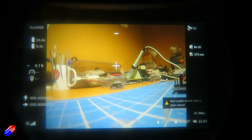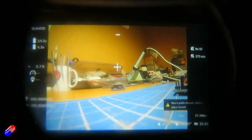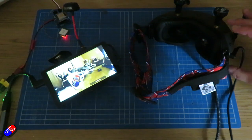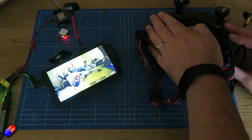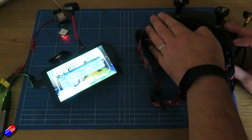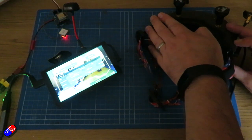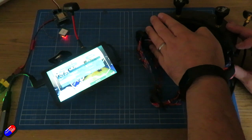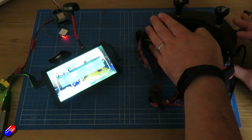I did also test this with Walksnail. Sadly, it didn't work with Walksnail. I've fed that back to David and I will be testing it, so as soon as there's a Walksnail-capable version available, that'll be great. It might need some tweaks with the code but I'll liaise with Walksnail as well. This should work with standard Betaflight MSP telemetry. I did change the OSD type in the Walksnail goggles to Betaflight but that didn't fix it either.